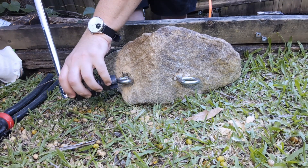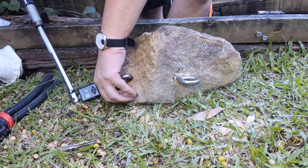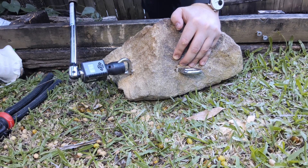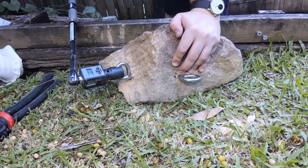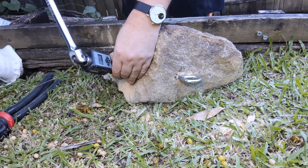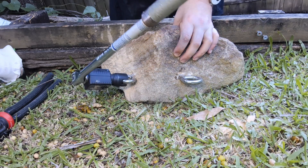Let's try the dirty one. Oh my god — 30, it was twisting and breaking the rock in there. Okay that's bad. Then it went up: 70, 80, going up to 90, 100, 107 — and it turned right around. So that's obviously a bad installation; that is not going to last very long. Let's see if it comes back the other way. Yeah, that's bad news — about 40. Basically 40 is what you could do with a hand spanner. That is not a safe bolt at all.